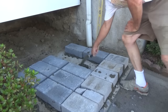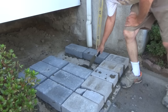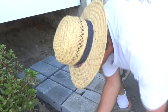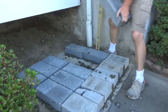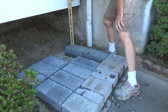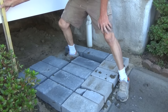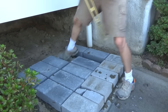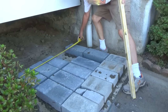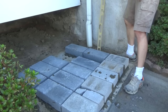Now I'm getting my whole base in — right here, this is my whole bottom. That's even with that first step, and then I build up off of that. I've got to go level down here, level over here, and then I measure. My stone's 49, I'm going 44 and a half, but my pattern will really tell me. The ruler I just second-checked that with.